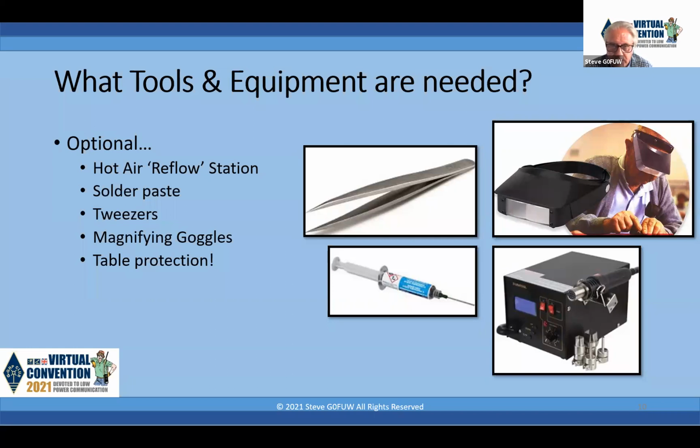If you're doing one component at a time, which is how I started, it takes quite a long time and it does feel quite laborious. And then somebody said, why are you doing it one at a time? If you've got 20 resistors to fit, why don't you put them all in place and then heat the whole lot? And it's so obvious when somebody tells you something like that. Of course, why didn't I think of that? Heating the board either with the hot air or the other techniques, and all these things being soldered at once is a revelation. It's brilliant. It works. You do have to go around afterwards and check that they've all soldered properly, but I'll come back to that in a moment. But it's great, it works, and I found it to be really good.